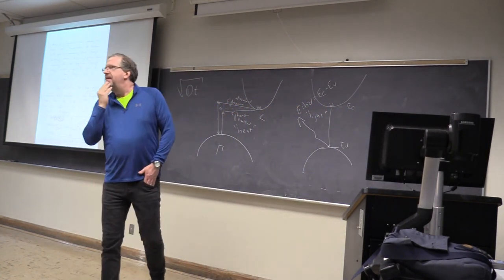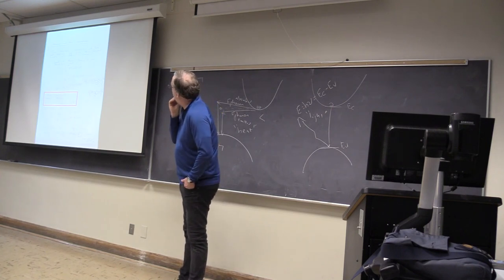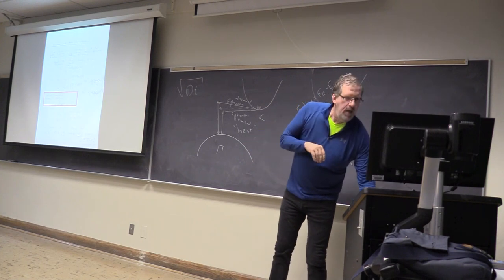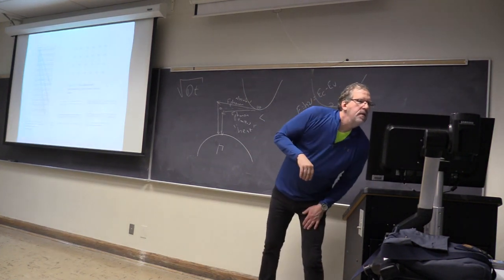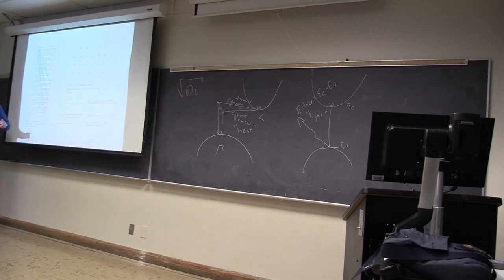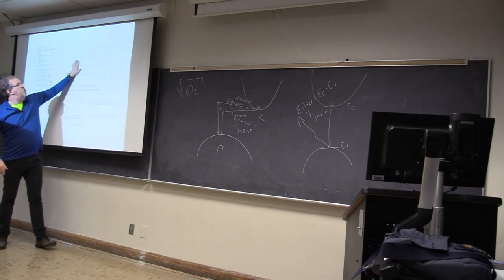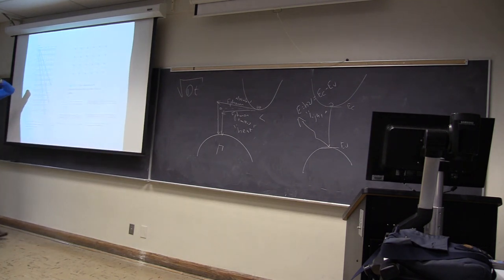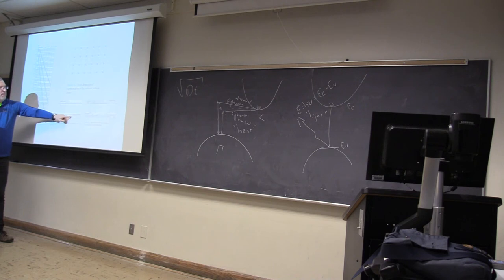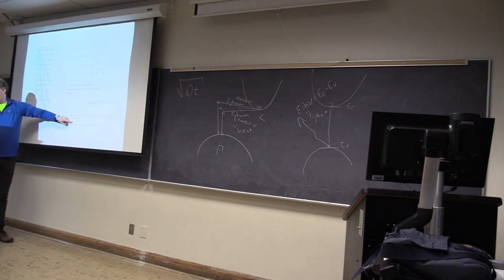Yes. Going back to the last slide, for the charge neutrality equation, what does Ni represent? The intrinsic carrier concentration. Okay. And it's not some sort of electron concentration. It's both. It's the intrinsic carrier concentration. We know that if this is not doped, this is all pure, unadulterated silicon, right? So if I have room temperature, I have some kT, some thermal yardstick, I have some probability that some electrons can jump up to the conduction band, creating holes, right? But that's going to happen in a one-to-one ratio, right? Yes.